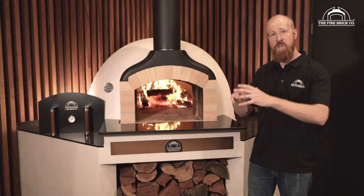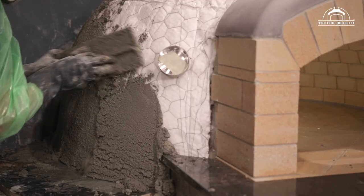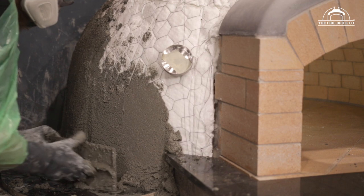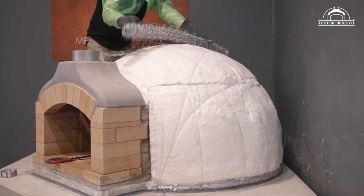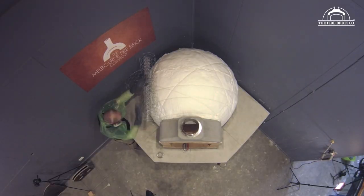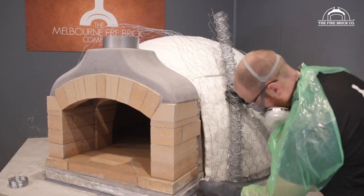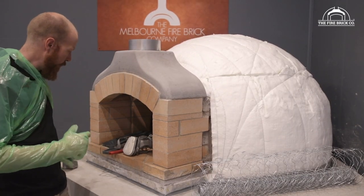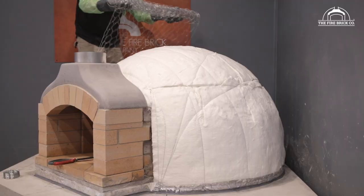In this video we take you through how to install the chicken wire that's going to hold your ceramic fiber blanket down and provide reinforcing for your perlite render layer. The chicken wire is very important — it's really what gives that perlite render tensile strength and resists cracking. We're going to put it over the dome, hook it onto our nail fixing points, pull it over the top, and lash it down — going from one side to the other first, then a second layer around the perimeter. We're still working with exposed ceramic fiber blanket, so wear your safety gear and particularly your mask.